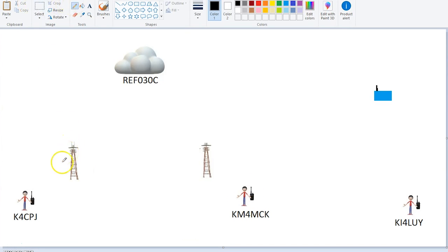Now what happens is when you're talking digital modes these days, Craig is talking with his radio to a local repeater on D-Star. And the local repeater is taking that into a gateway, which goes into Reflector 30 Charlie. On the other side, John is also communicating with his local repeater 300 miles from Craig, and that is also going through a gateway going to Reflector 30 Charlie or wherever they happen to be talking. So Reflector 30 Charlie and the repeaters are bridging the gap from Craig to John 300 miles away to talk on D-Star. And the same thing can happen on Fusion and DMR and P25.